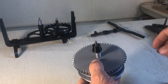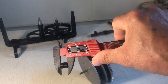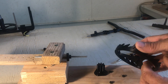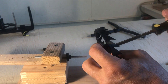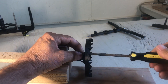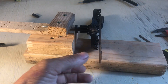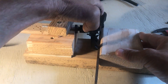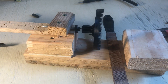Front bushing, then the front gear. There's one more spacer on the back. Another escape wheel and gear — it's two parts, screwed together. I used a jig to align them. Play with it, move it until it's almost warp-free, as good as it can be. Then use a file and just knock off the top of the teeth. That looks good.